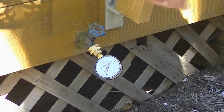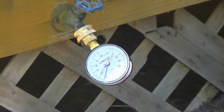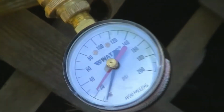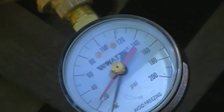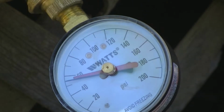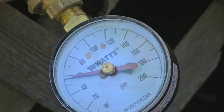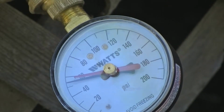Okay, and with that we're going to go upstairs. Okay, this is a dynamic water pressure valve. We want to prove with this valve that installing our water flow management device will not reduce building pressure. So let's go ahead. As you can see, building pressure is about 55 pounds of pressure before the installation of the valve. We'll come back later and take a look at this again.